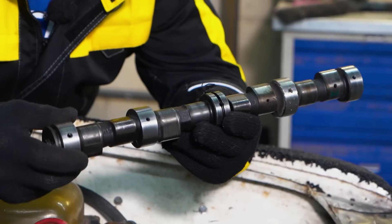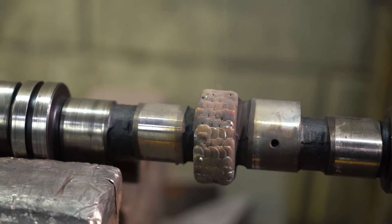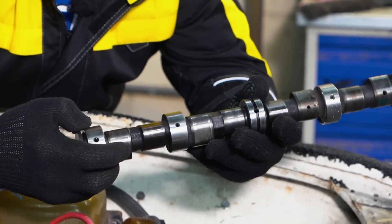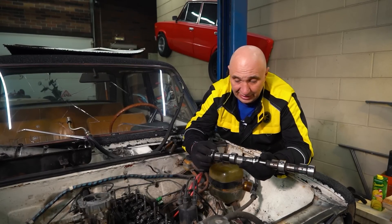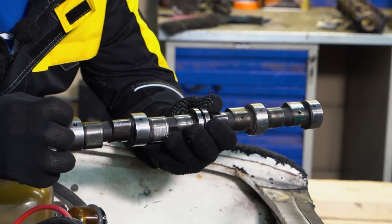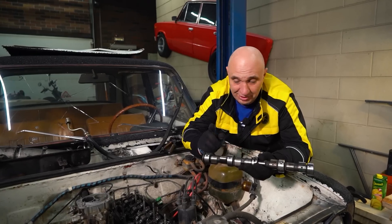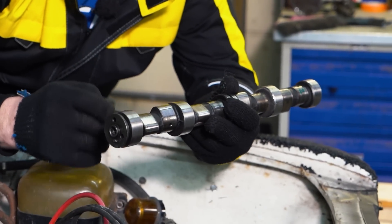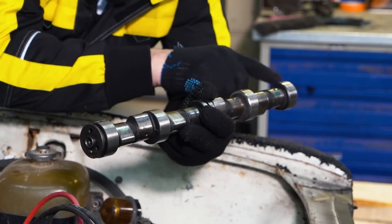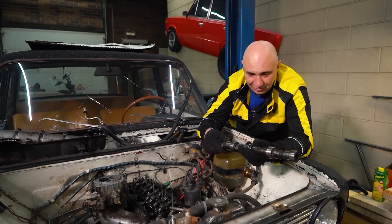Here's what we've done: one journal we machined, the other we added material to, to make the diameters right. Now we just need to swap over the end journals, because this is the one that you would fit the cam gear to, so it has to be on the front. We'll chop these off, swap them over, and the front journal will sit at the rear while the rear journal will move to the front. We'll end up with an inverted camshaft.